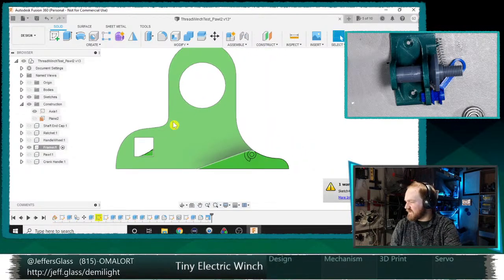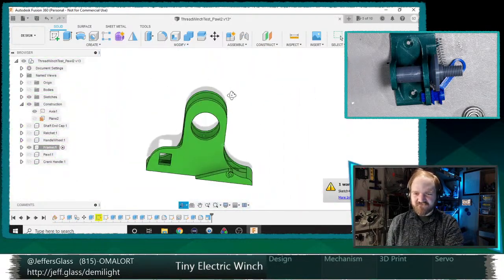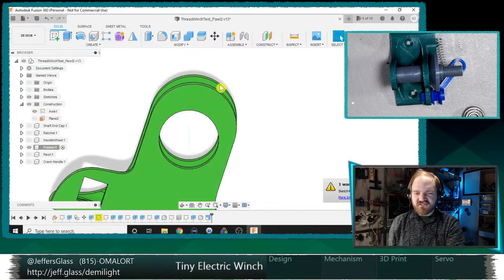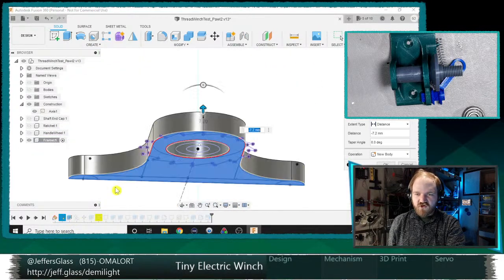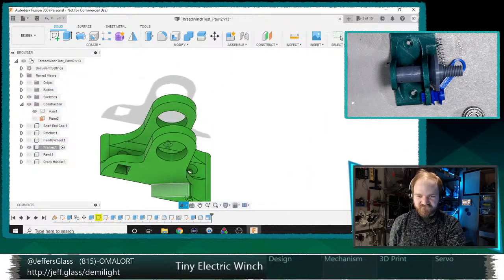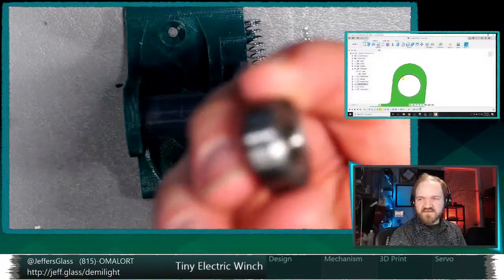7.1, yeah, something like that. Oh, yes, I see. Thank you, Chris. You may have lacking constraints. Yeah, very casual design, it turns out. And now I'm looking at it, I kind of want these to be... I guess the primary load in most applications is going to be upward, or, you know, in this direction, away from the thing. I extruded more than the 7, says Chris. Oh, yeah, a 7 plus a little bit in this dimension here, 7.2, I think, is what you're looking at. And that'll be okay. I just want a little bit of extra plastic hanging out on either side.